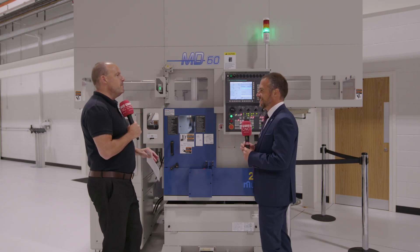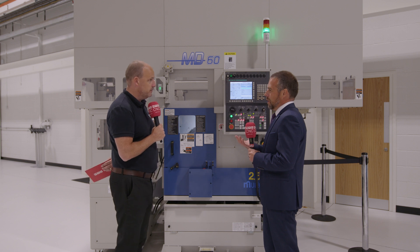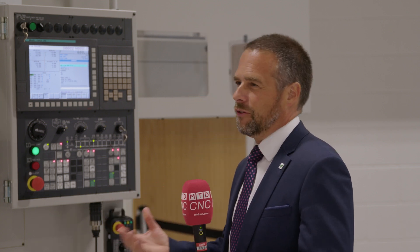Terms and conditions apply, but where does the skepticism come from? A lot of people say 'I only make a batch of ten off.' But a batch of ten can easily run through this machine as well. The extra time to set the stocker is minimal — the normal approach is to set the machine up, send the first part to inspection, and while your inspector gives you the go-ahead, you set up the stocker.